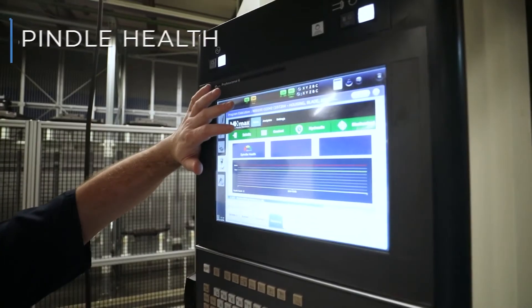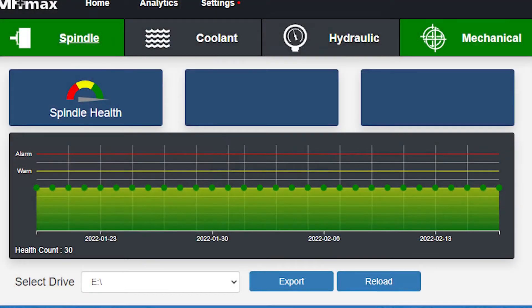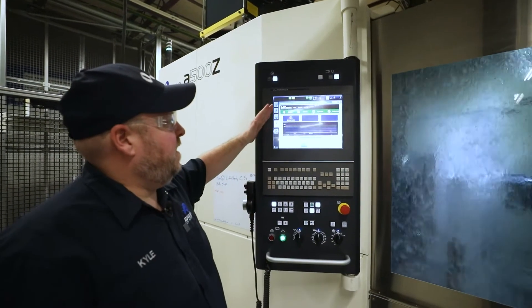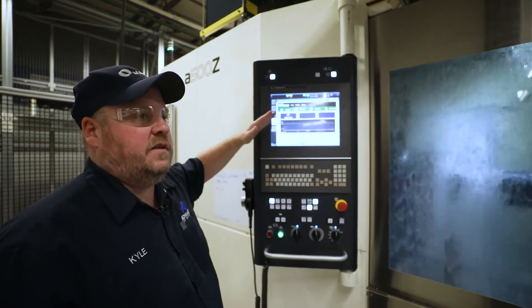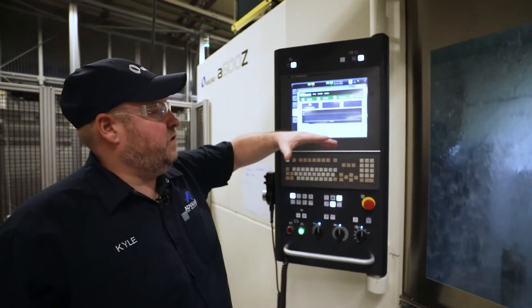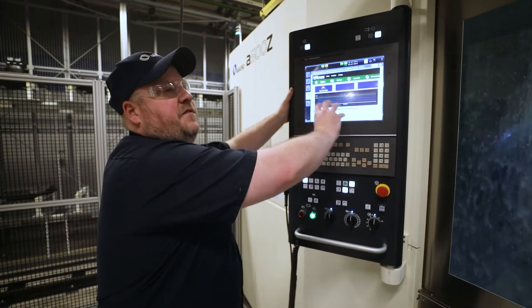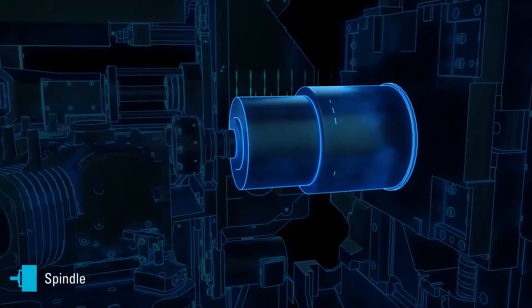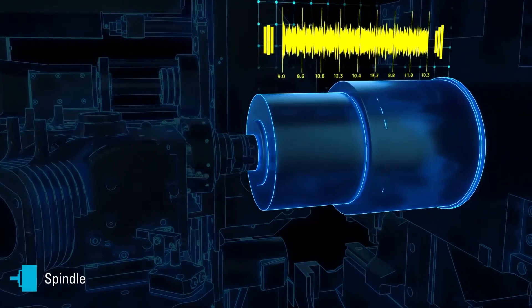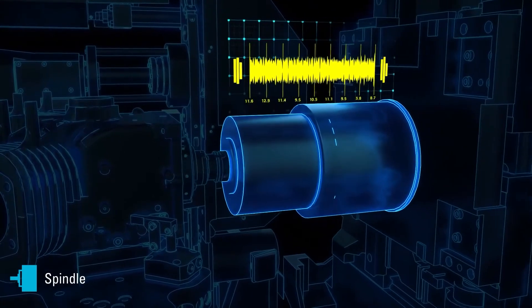This is where it analyzes our spindle health. As you can see, there's no warnings—everything in our spindle health is green. If there was something wrong, if maybe a spindle bearing or something was interfering with the spindle, a vibration, when you record it and run the program for MH-Max for the spindle health, it'll give you a graph and read that graph and say whether you're good or bad, or you might need maintenance, might need to change your spindle or your chiller oil sooner, and so forth.